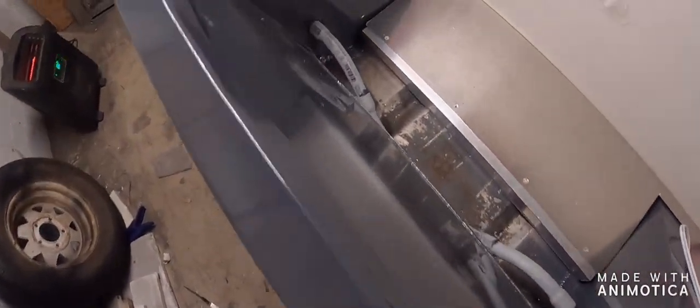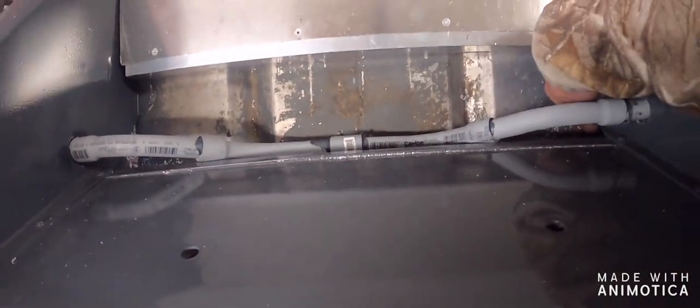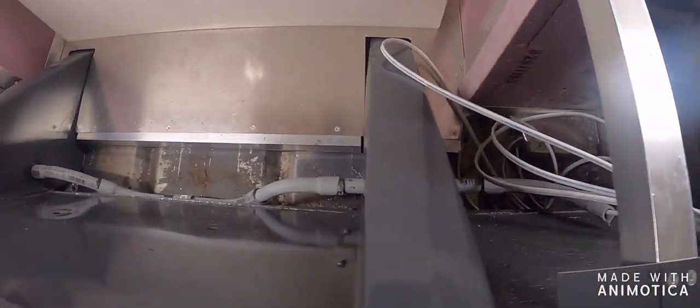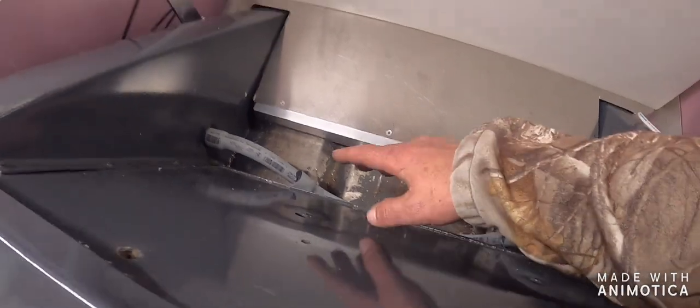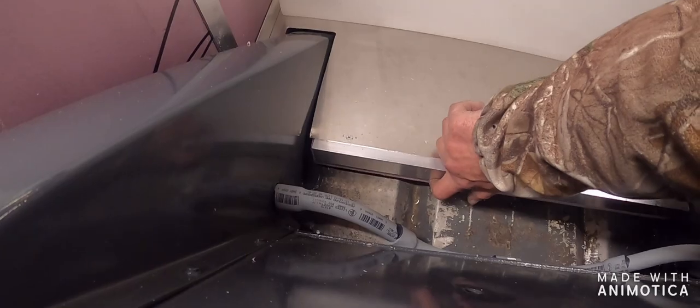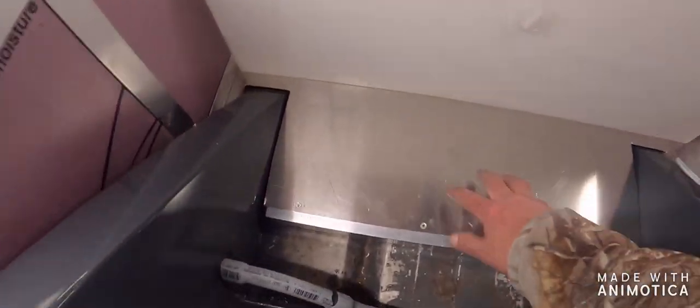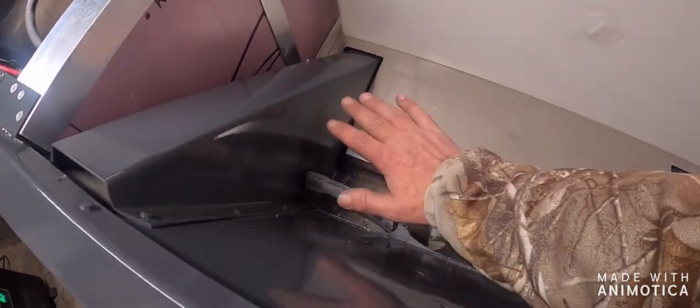So any water that collects all along the back side has to be able to travel back against the transom, get underneath this hole down here, come over here, and get out. That is why I leave mine back 4 to 5 inches from the back of the boat, so water can travel there. You just got to keep that clean. There is 2-inch foam there, and it is rigid, so I can set my gas tank back here. There will be gator skins back here.